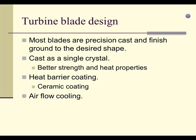A lot of blades are hollow — made in a mold as kind of a shell with internal baffling inside. One turbine blade, looked at carefully, is almost like a scaled-down airplane wing: it has an airfoil shape, internal structure, and lots of voids. They use lasers to bore holes right through it, and that's set up to accept bleed air from the compressor, so there's a constant flow of bleed air going through the blades for internal cooling — called airflow cooling.